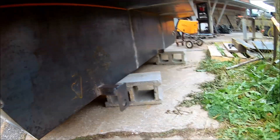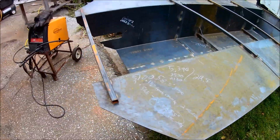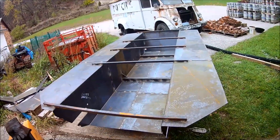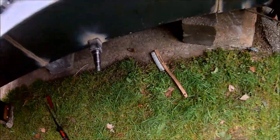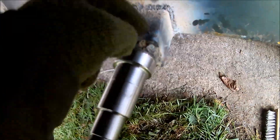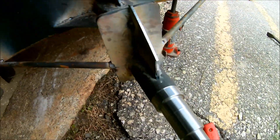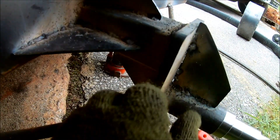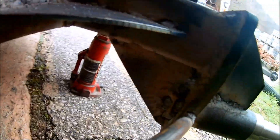Everything should be nice and watertight, then I can mount my wheels, and once it's all rolling I'll slip the differential in. Got all the stub axles fully welded and gusseted. The walking beam stub right here — I didn't gusset this one, didn't think there was a need. It's a short stubby guy, so it'll bend before anything else does. I did a little tweaking on the upright for the rear axle — I was worried about this 3/8 plate twisting from torque, so I added these half-inch bars to help mitigate the torsion action.